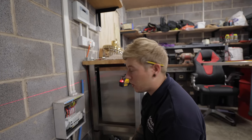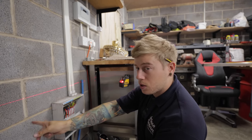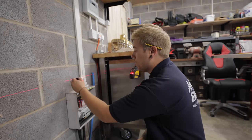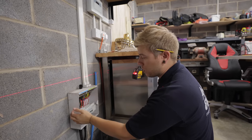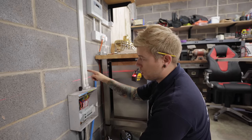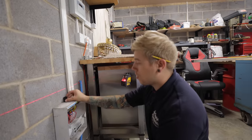I was sussing out in my head what I was going to do - I said I might have taken conduit from this one behind me to the column, and then one out the side through to next door. But looking at it under the stairs, we're just going to do one piece of conduit at the top. If the board's ever changed then it's less entry points into it, and I can wire my singles just in my conduit and not have to go back through the board.